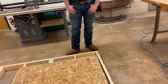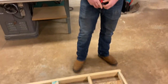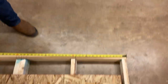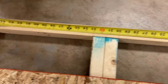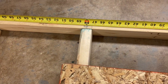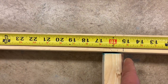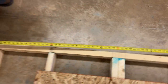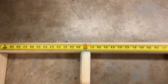First thing I want you guys to know is, Shane, pull out your tape measure and show me the layout across the bottom right here. The 16 is in the center of my stud. 32 is in about the center of the stud. The 48 is in the center of the stud. Now notice, had I started this stud right here at 16 inches, the stud would be over here and my plywood would not be breaking — because by the time I get over here at 48, the stud would be over here and my plywood wouldn't work.